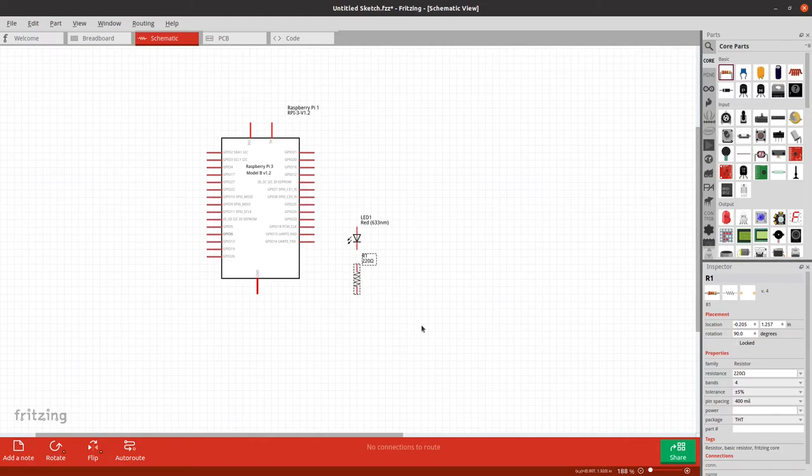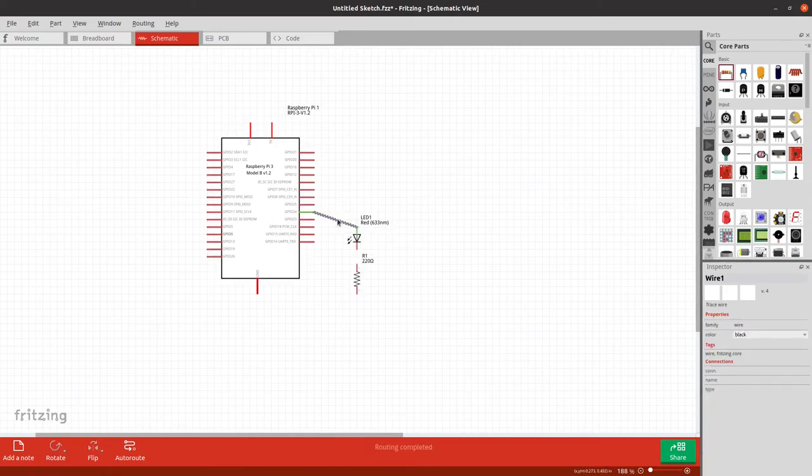And this is going to connect to GPIO 24. We don't want lines crossing at horrible angles. When you're creating a schematic, then there's usually some guidelines that people follow. Usually if you've got a positive voltage, that would be shown at the top. So we'll be showing connecting the 5-volt supply to things from the top. We'll also be adding a separate 20-volt power supply. And then the ground is usually at the bottom.